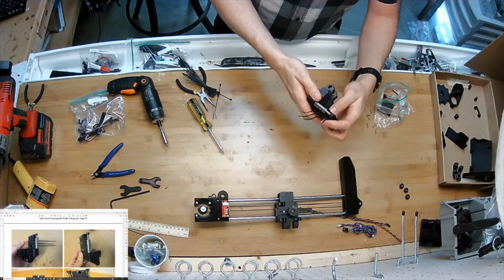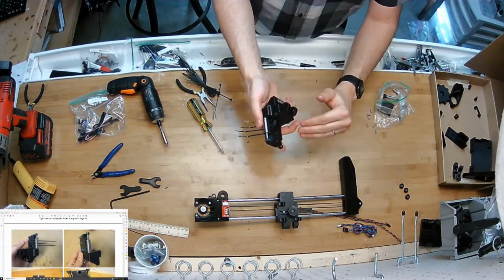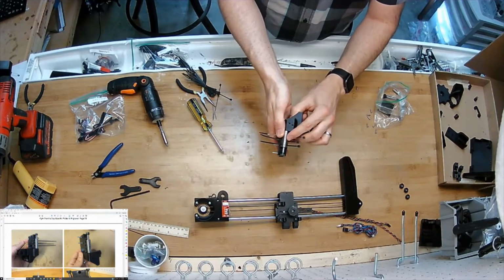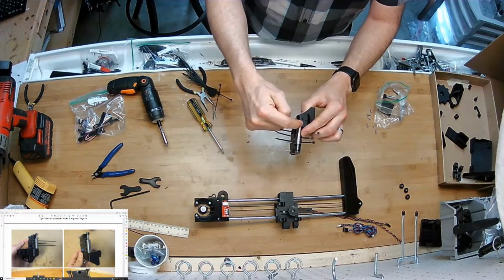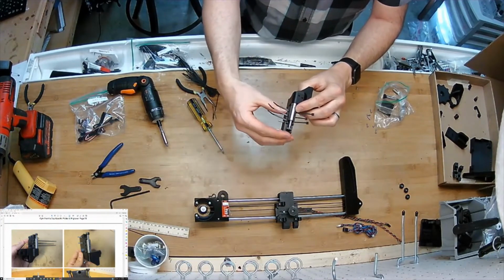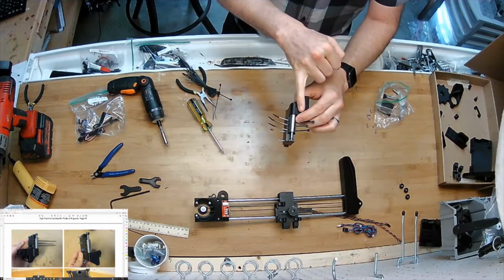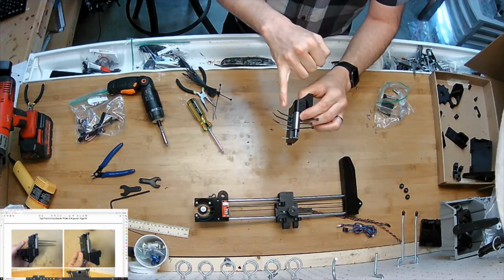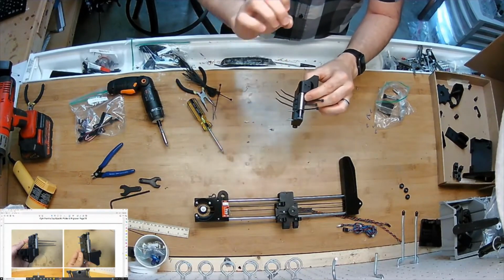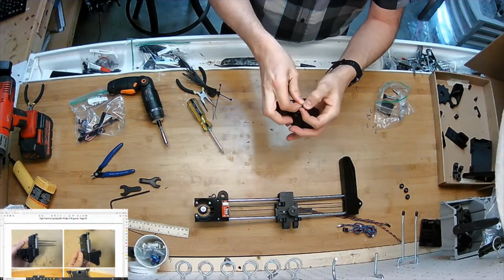And let me see, I'm going to take that row of bearings. So here's the other part of that. Once this is fully assembled, if you have this line positioned here, lined up between rod and rod, then that's going to make this assembly tighter. And if you turn this at 45 degrees, then it'll be between 2 rows of ball bearings, and there'll be a little bit more wiggle space, just a tiny bit of adjustment. But sometimes that's all you need. It's a good trick to know.